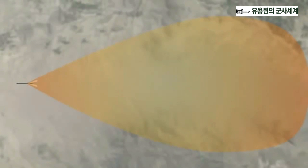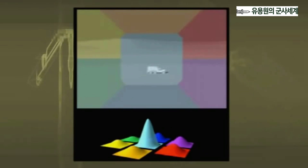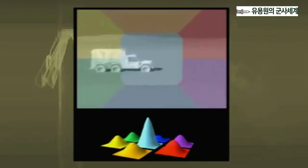In testing, the sensors acquired laser target data as far away as 14 kilometers, well beyond the range of the rocket motor. During flight, the seeker electronics interpret the intensity of the laser energy and determine the angle to the target. This information is sent to the guidance system. The proportional navigation software maintains the closure angle for stationary and moving targets.